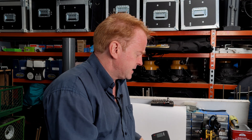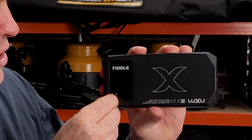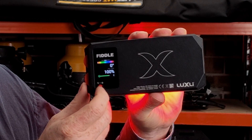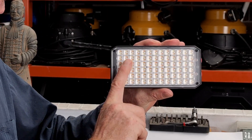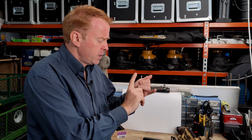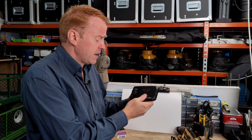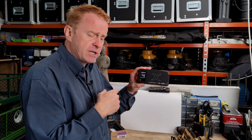The user interface is largely the same logic but has changed a little bit. We've got two rollers here. To turn the unit on, flick the switch across, and then to change your light modes, flick the button across — giving you three light modes operable manually. The front of the light consists of an array of lenses, and underneath each lens is a group of emitters: red, green, blue, white, and amber. The amber is a broad spectrum emitter that enables this light to get really high color scores at low Kelvins.